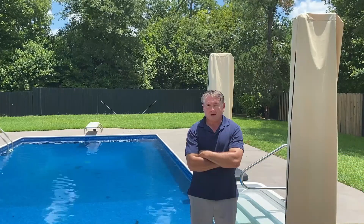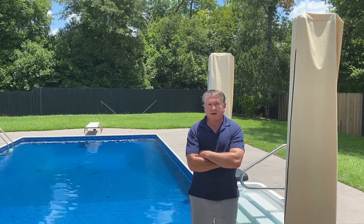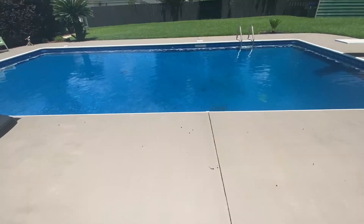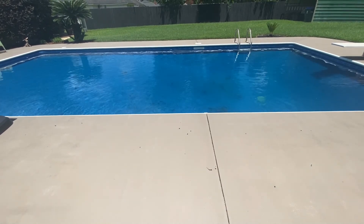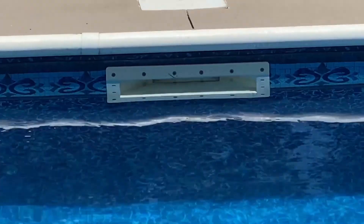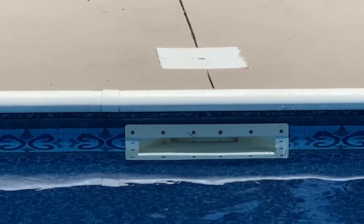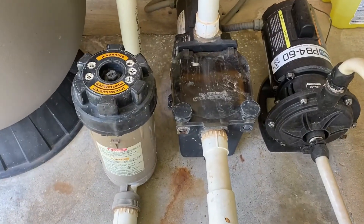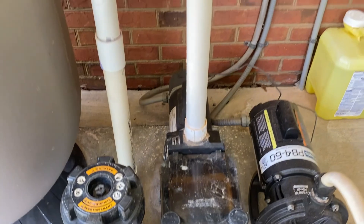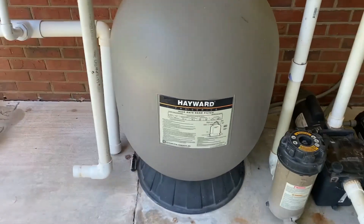Now if my water level was too low, I would simply add some water to my pool. My pool has an automatic leveler — a float control system — but it doesn't work, so I have to use a water hose. Before we lower that water level, let me show you some of the major components of a swimming pool. Obviously, the large body of water is your water source. This water will then flow into the skimmer, which has a little collective basket behind that little panel on top. The water is then pulled through by the filter pump, which has a little filter basket, and the water flows through a pipe through the selector and is forced through sand in the sand filter.